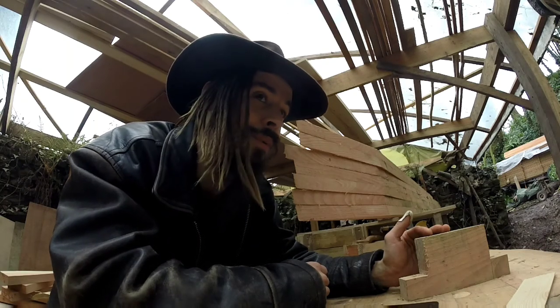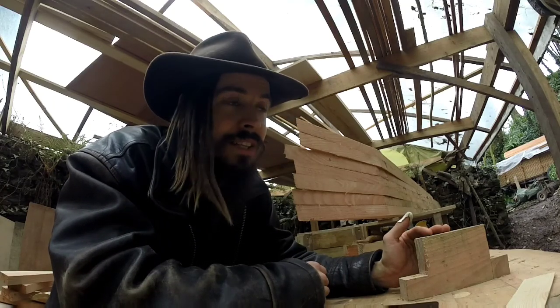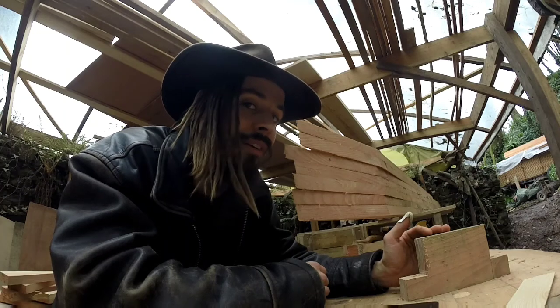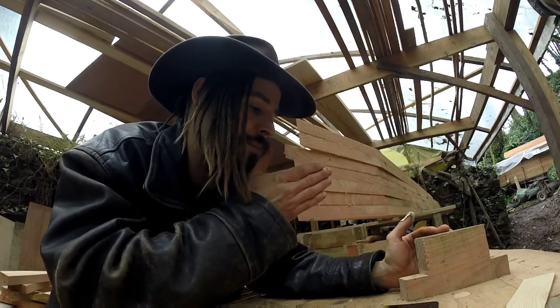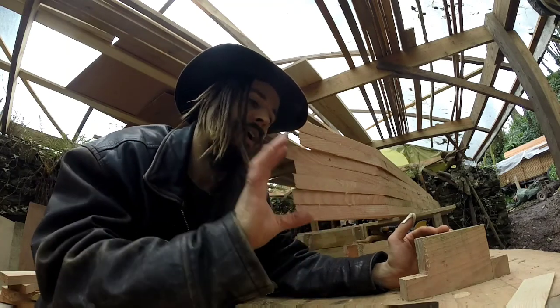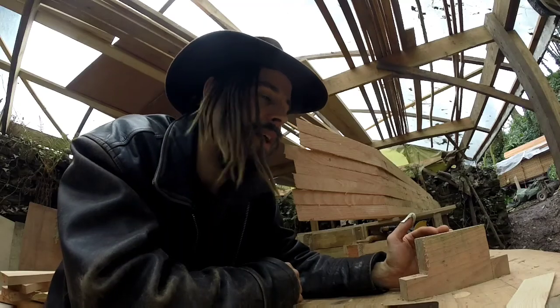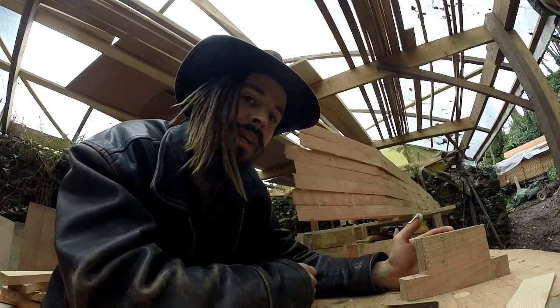and then we will be fitting the beams on the back wall, which will be some oak that we need to cut to length, drag into the shed, and then strip the bark off it. And then they will be axed flat on the back side because they're fitting up against the existing wall in the shed, and then they will be notched out to take the beams.